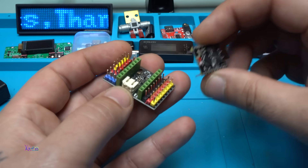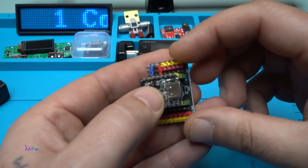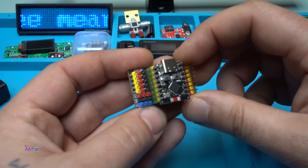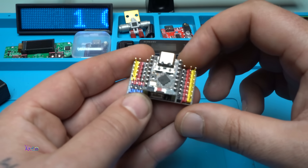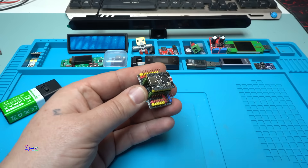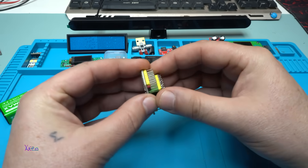If you have a USB ESP32 C3 Mini module like this one, you attach it like this — and now you have many more pinouts for power supply. The digital output, input, and analog input pinouts are the same, but you get more 3.3-volt and 5-volt pin headers and ground. It looks awesome — this will be useful for my DIY projects. It goes in smoothly, it's not super tight. That is nice.